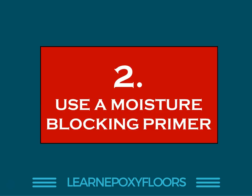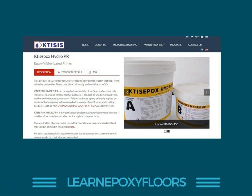The second choice is to use a moisture blocking primer — these are usually epoxy based. Here is an example of my product; I'm posting a link below. This is a solution, but not the only solution. I want to emphasize something with epoxy-based moisture primers: yes, they can hold moisture back, but if there's too much moisture or too much pressure, they are still not enough to stop the problem. Some people assume they have a magic product that will solve all their problems — that is not the case. Moisture blocking primers are a good solution, but not necessarily the ideal solution.